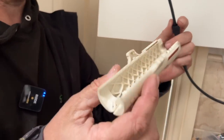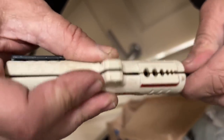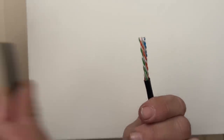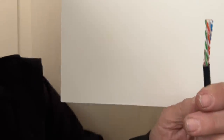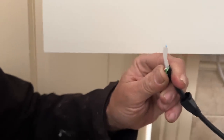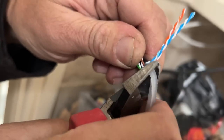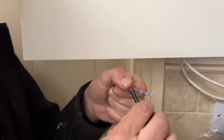I'm going to put this boot on - it's not very important but it does look a lot better. Put it on about four inches back. I'm now going to get my stripping tool - this is a tool by NipX, you can find it on Amazon. It's about 30 quid, really expensive, but as you can see it strips the cable every time and never nips the cables underneath - it is fantastic. This cable is exterior grade, you can put it under the floor, it'll last for years. There's also a little strengthener in the cat six - I'm going to cut that off. I'll grab my nips and chop that off, being careful not to cut any of the strands.